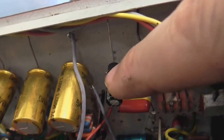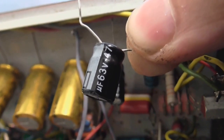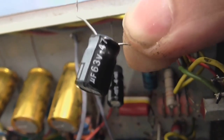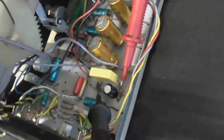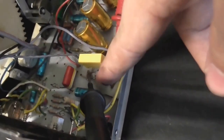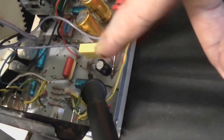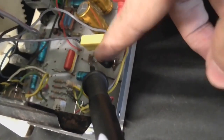I'm going to replace that capacitor with this one, which is rated for 63V. And if that one blows, I don't know what I'll do. I have now replaced that capacitor, and I've also bridged a small non-electrolytic capacitor across it, just in case there are any high-frequency components. This little capacitor will take all that away from the main one, so it shouldn't fail prematurely.